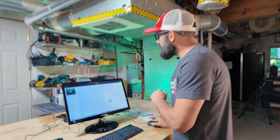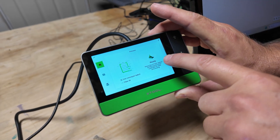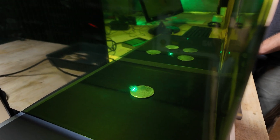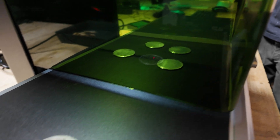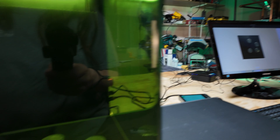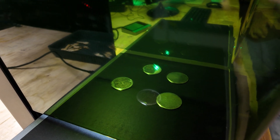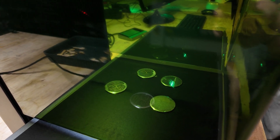So let's go ahead and fire it up. Hit start up here — that doesn't actually start the job, but it sends the job over and signals it's ready. Now hit the green button to start the project. It's going to do the first one, then bring in the other four. Over here on the software you can see it's looking, recognizing the material, and once it's recognized it starts engraving. The talc powder isn't affecting the engraving at all — it's just helping the vision system recognize those extremely shiny objects more easily.